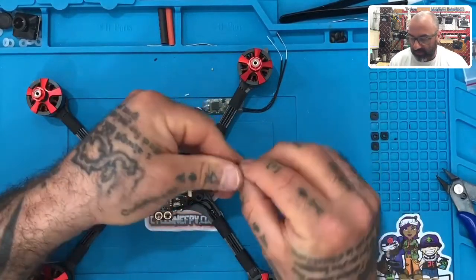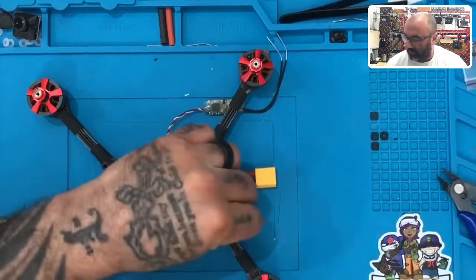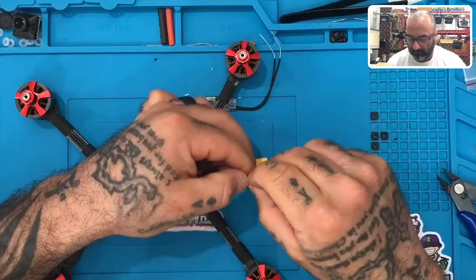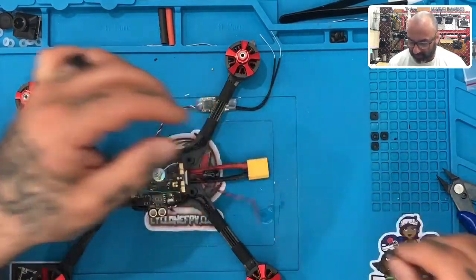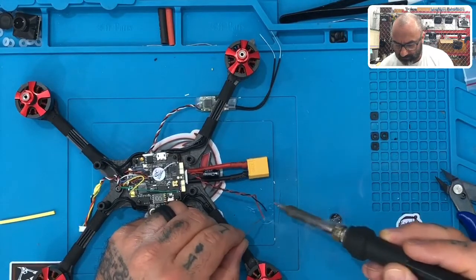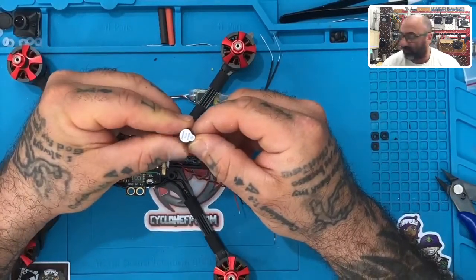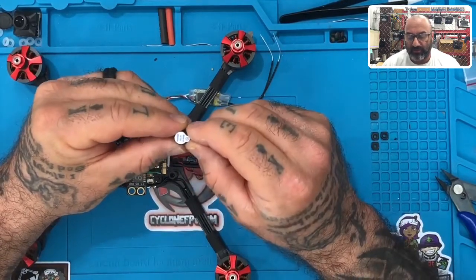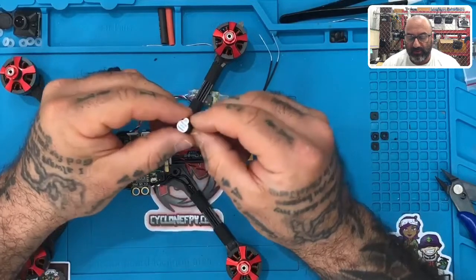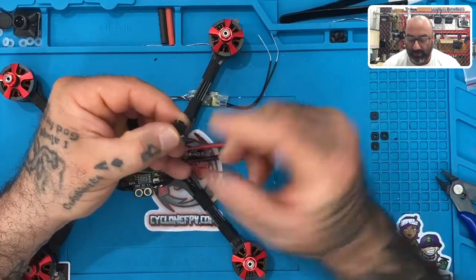I'm not going to cut much of this cable away because I don't know where I'm going to put it yet. I'm going to untwist the black and yellow — the 5 volt and the ground for the buzzer — and I'm just going to tin it real quickly. Now look at your buzzer very closely: if you look at this side you will see where it says positive. Just look at the positive — the plus sign is on this one here. Usually there will be a height difference, and the positive will be just a little bit longer of a wire than the ground.